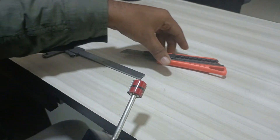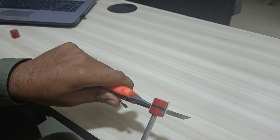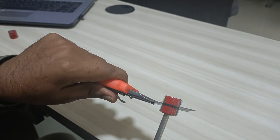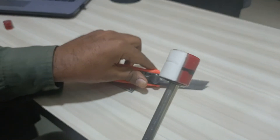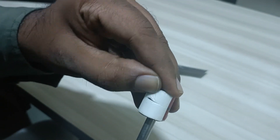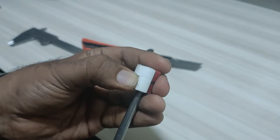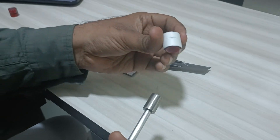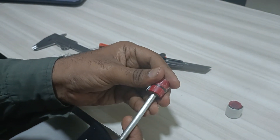Now we test it on another unit, which is a blade. When you raise this and go 25mm to the right, 25mm to the left, you can see that the tape has scratched off and we can see the black exposed portion. Whenever the black exposed portion is visible, it means that the tape is damaged — the edge is a sharp edge. You can just replace this tape with the next tape and continue with the testing.